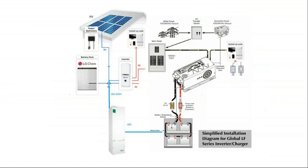We talked about load control. What I wanted to end class with was a design proposal where we try to have all of our cake and eat it too. What we want is a cheap battery inverter that might only be an off-grid battery inverter, one that is cheap but powerful enough to run the entire house off-grid. We need that because our grid-tied solar inverter, even if it has battery capability, is not large enough to run your entire house. And maybe they work together too.